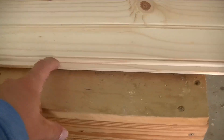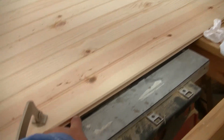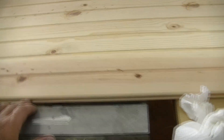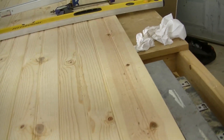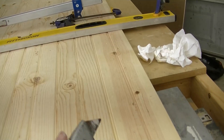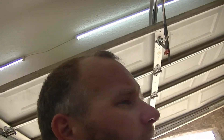After a little while it should be pretty set. I'm going to cut the tongue off of this end because I don't want that showing, but I'm going to take this tongue and shove it into this groove here — you can just take that piece and slide it in there. It works pretty well; just glue that in there. You also want to remove all the glue you can see between your seams, because if you don't, it becomes really hard to stain and it's hard to get into these little cracks to sand anyway. I just took an X-Acto knife — utility knife — and went down into the groove and got all that glue out. If you leave it in there, it won't stain well and it'll leave a weird color.